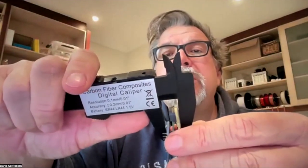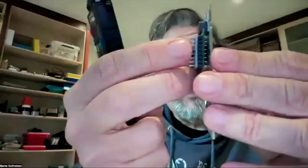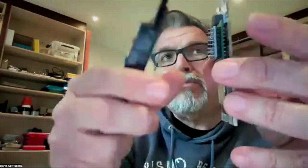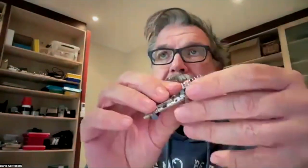So I'm just going to measure this thing here. If I don't take the holes, it's 2 millimeter too high. So this is 11.8, and I'm measuring including the 1.6 for the PCB, okay? But I have this standoff built in here to these holes, so I could probably shave something of that off. So if you take the microphone, do the wiring, put electric tape on, and then put the microphone as close as you can, then it will probably work.